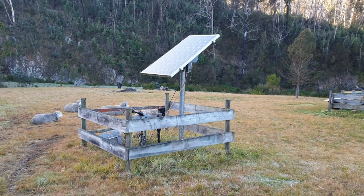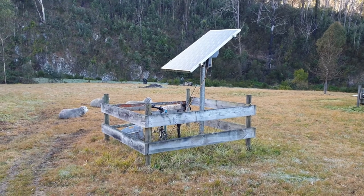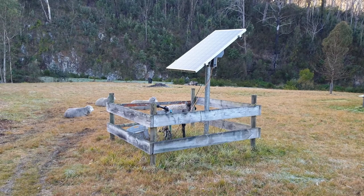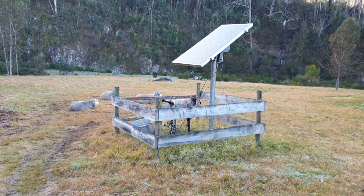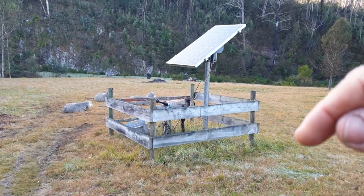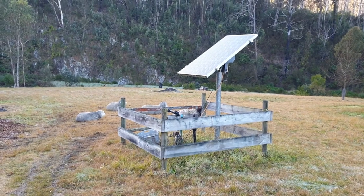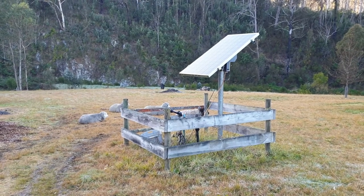We've got our bore here, our solar powered bore, which has been out of action for the last couple of months. So we've got Steve, the boreman, coming in today, hopefully, to come check it out, see what the go is. We may have to pull the pump out from down the ground, but anyhow, the hole for our bore is about 33 meters deep. Where the pump is, it's down about 24 meters, so they call it the drawdown level. So we're going to check it out. Steve will do a few tests on the electrics, I suppose, see if it's anything up with our controller box, and then take it from there.